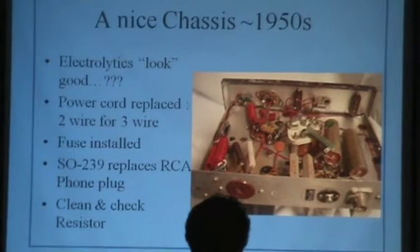I was afraid it was going to hit the sprinklers, flood a brand new lab, not be fired. So we wheeled it out of the room and let it smoke out into the hallway. But it was a power transformer. Power transformers will oftentimes heat up like crazy internally, and by the time they start smoking, not only are they destroyed, but it may smoke a while. That thing was a good 10, 15 minutes before it quit smoking. So you got to watch out.